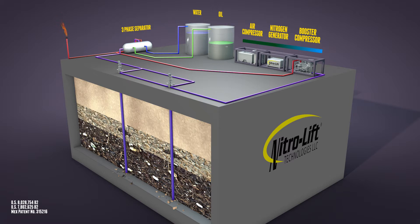This process continues to lift the wells until the system pressure is interrupted. At that time, the NitroLift Dry Pack Generator System senses the drop in pressure and automatically delivers makeup gas as needed to continue lifting.